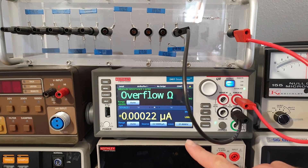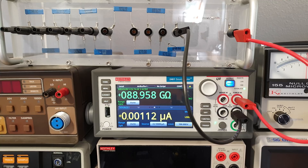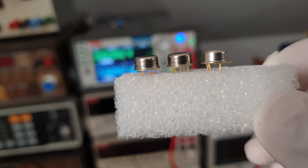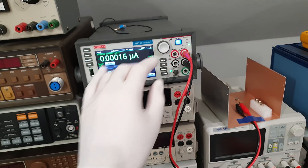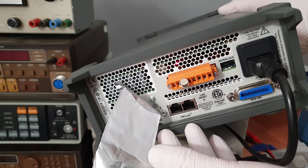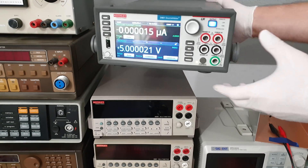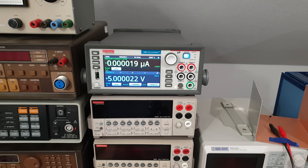In really high impedance circuits too, but I think here we would need shielding and guarding again — because this is supposed to be a 1%, 100 gigaohm resistor. These are hermetically sealed low-leakage diodes, half a pico-ampere according to their datasheet, for $20 a piece in single quantities. With long test leads on the front panel, we are getting over 50 pico-ampere readings. Just by using the screw terminals and a flappy piece of aluminium tape for shielding, things get much better. So in conclusion, I miss my triaxial connectors, but for what this thing has been designed, it's all good.